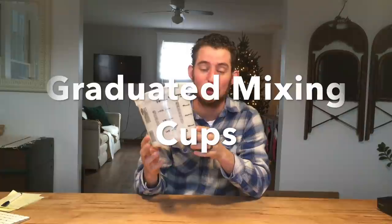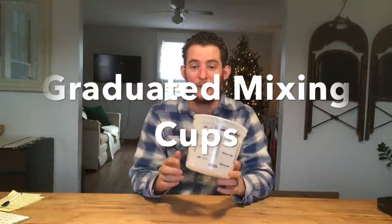Tool number one — you might not consider this a tool, but I think it's very valuable — is a mixing cup. The first thing you do before you start the project is mix the epoxy properly. What I like about these mixing cups is they have graduations on the side, which makes it easy to pour the right amount of hardener and the right amount of epoxy. This is a two and a half quart cup. I'll pour one liter or one quart of hardener first because the hardener is thinner, and then I'll pour in the epoxy, which is a lot thicker — it's more like syrup — and I'll pour in the second quart. Because you have the lines here, it's very easy to get the exact same amount of each product. Tool one is the mixing cup.